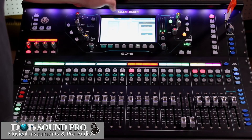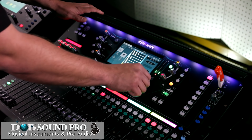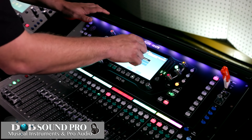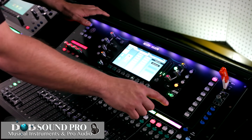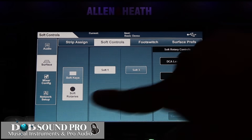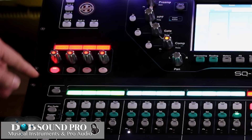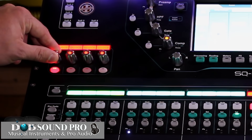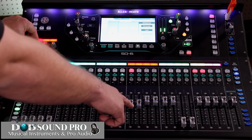Next we have 16 soft keys which you can program to be whatever you want from the options given to you. You can see that I've chosen to have my soft key 8 be my global tap tempo. Here we also have the options of programming our soft rotaries, which are found on the SQ-6. You can see that I've associated each rotary with a different DCA group. I can control the send of that DCA programmed on my soft rotaries and you can see that they work directly with the channel strip.